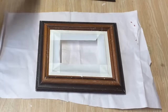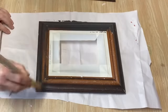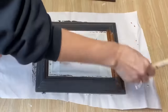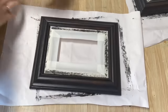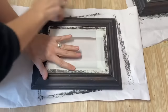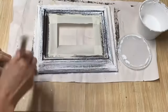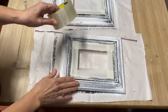I've got all the wax on and now I'm going to put a coat of black chalk paint over the whole frame. Wherever there's a little bit of wax that paint is not going to stick there, so you're going to get that layered look of the paint color underneath. The coat of black is all dry — I'm going to use another coat of wax and then put a coat of white chalk paint. These are all dry.